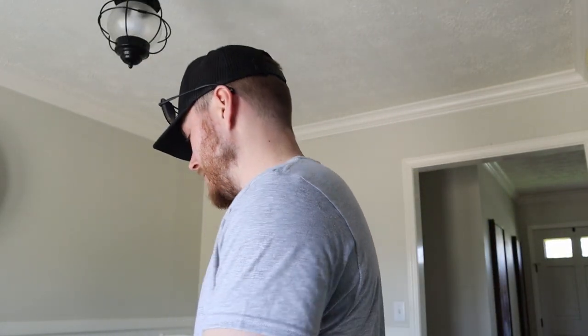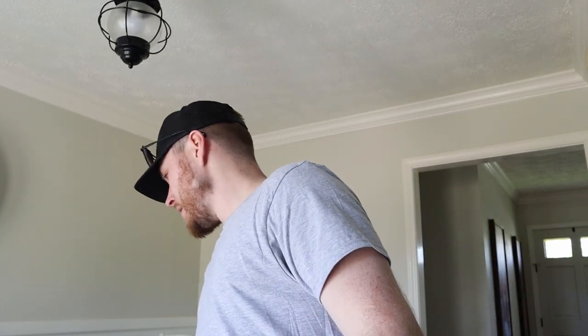With that setup you've got a hundred-foot garden hose. I filled the drum halfway up. The suction hose is a little too long — I do need to cut it. But for 300 bucks you can get a dolly, strap that ten-dollar drum to it, and move it wherever you need to. Make your batch — a five percent batch for a roof is usually the standard. That would be about 30 gallons of water and about 25 gallons of 12.5% bleach. That's how you make a five percent batch.